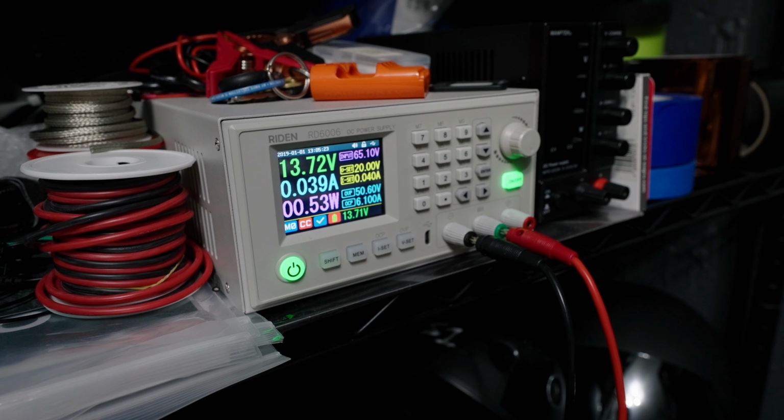And then one day you go to charge it again, there's an internal short somewhere in a cell in the pack due to the damage that was incurred when it was totally undercharged, and now you have a catastrophic failure in the middle of a large battery that you cannot get to, and so the entire battery incurs a catastrophic failure and you're left to deal with that, however that may manifest.